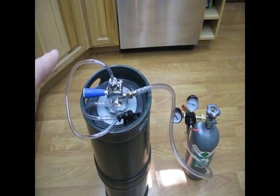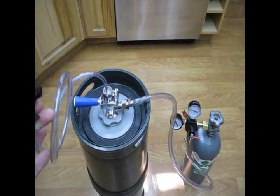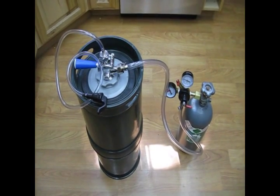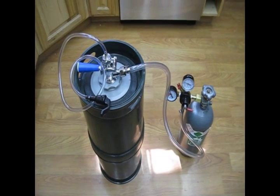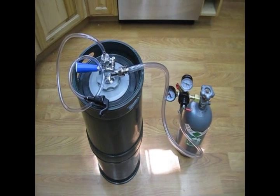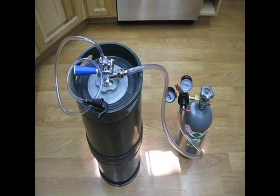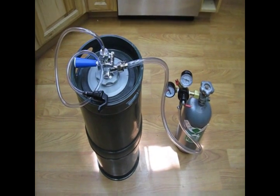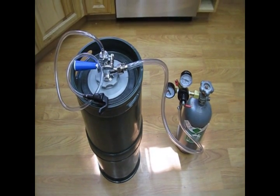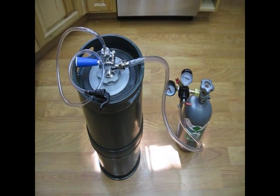We've also got the actual fill valve or serving valve hooked up to the outlets of the coupler. The purge process has three functions. First, we want to purge out all the oxygen from the liner that was drawn in during the installation process. The second function is to actually open up the liner and deploy the liner within the keg itself. And the final check is to verify the seal integrity of the fitment against the o-ring on the valve handle.